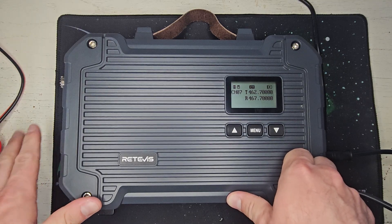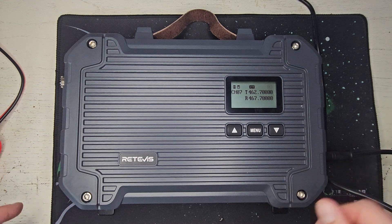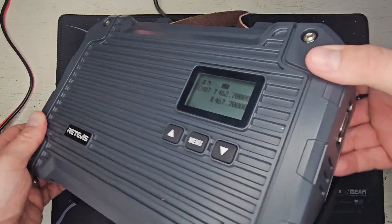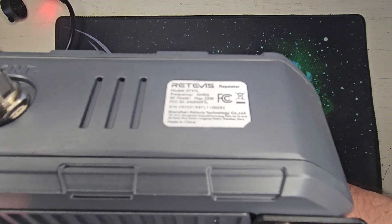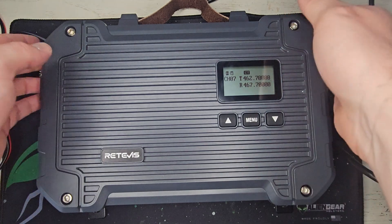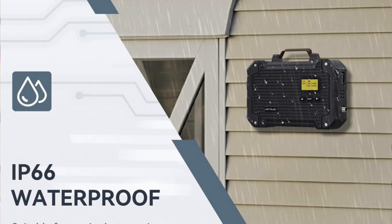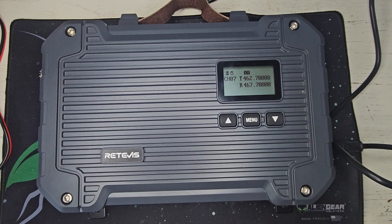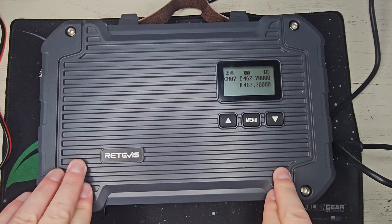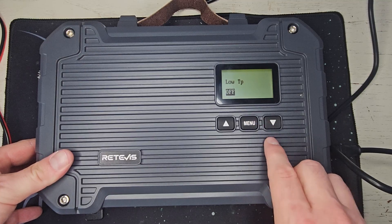The software couldn't be any easier to use. I'm not that great with computers and I plugged it in and had it working in just a minute. If you've messed with the MXR10, the internal programming is pretty much identical down to a T. So as discussed before, this is a 22-watt repeater. With that metal case, the waterproof case that it's in, the IP66 rating, this can actually be placed outside in the rain, the snow, whatever. A very interesting feature of this repeater is it has an internal heater that you can turn on inside of it. The low temperature setting is right here and you can turn it on or off.